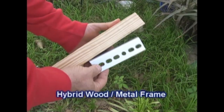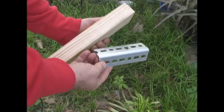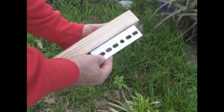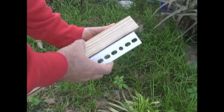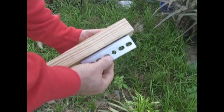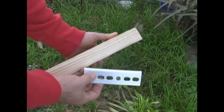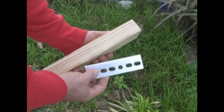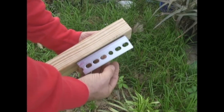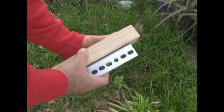This is what I call my hybrid design. I make a traditional frame out of pressure treated lumber, but then take pieces of angle iron five or six inches long, cut them, and mount them in the four corners of each panel space in the frame. Then I mount the panels right to this angle iron, aligning these with the holes on the panels themselves. If your frame is not quite dry yet and your lumber is a little fresh, you can go ahead and mount your panels and leave a little bit of slack — just finger-tighten them, then come back a month later when the frame has dried and shrunk a little, and go ahead and cinch them down.